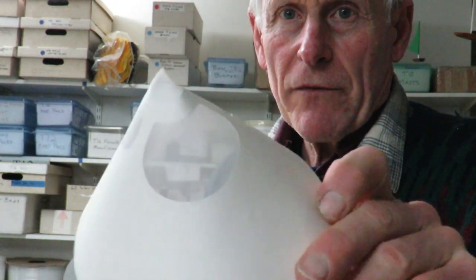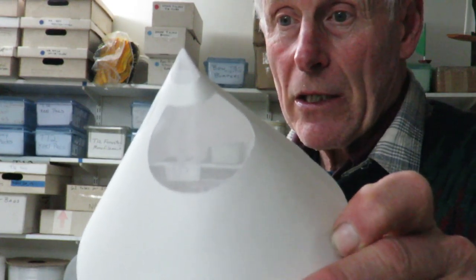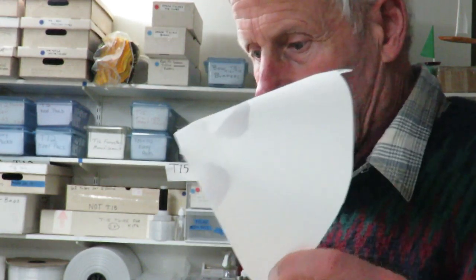So a nice varnish brush, and then we have a varnish filter. You say, oh, that's a paint filter, isn't it? Well, it's sometimes called a fine paint filter, but it's much finer mesh on the bottom than a real paint filter. Otherwise, it is the same. Paint puts on a thicker coat, so you don't have to screen out such fine particles, whereas varnish puts on a very thin coat, and if you use a paint filter, you're still going to get bumps in your varnish that will show, that will be bigger than the thickness of the varnish finish coat. So you can use a fine paint filter or a varnish filter, which is the same thing, for paint, but you shouldn't use a regular paint filter for varnish because it won't work very well.